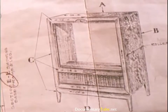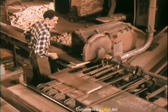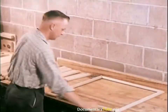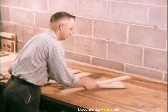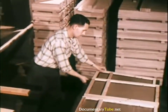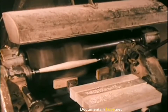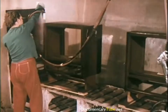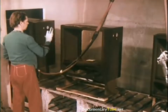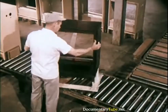Workmen in these plants are skilled craftsmen who come from families where woodworking is a tradition. Starting with selected raw materials such as mahogany planks, these craftsmen proceed to transform them step by step. Cabinet parts are carefully matched so that the color and grain of the wood will be complementary. The machine used here is capable of making fifteen different cuts simultaneously and is accurate to within one sixty-fourth of an inch. Two cabinet legs are carved at the same time and then cut apart. Some cabinets receive as many as twelve finishing operations, each receiving multiple coats of lacquer to produce depth of finish, seal in the quality, and protect the rich beauty produced by quality craftsmanship. Each cabinet is given a final inspection.